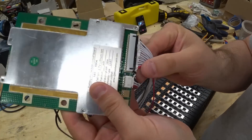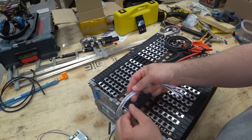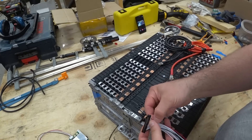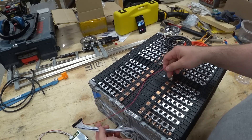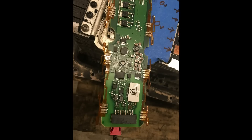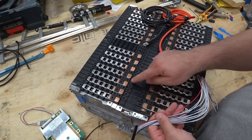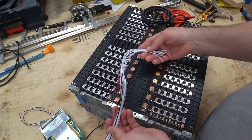Let's go ahead and take this wiring harness off. The harness runs off to one side and the positive-most lead is over here, so we want the red one to run to this side. This wiring harness needs to attach to each cell — the same way the original BMS was attached on this battery — so I'm just going to use the same locations. We'll have to clean this up and prepare it for the wiring harness.